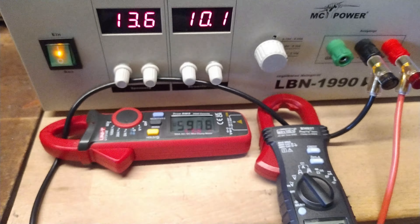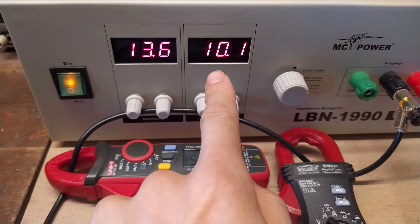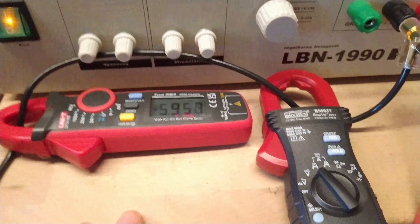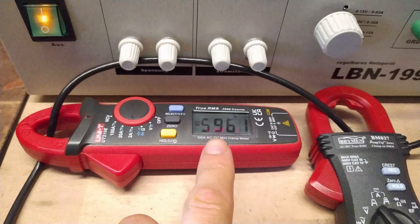If you have a very noisy source of current, you can see we're pushing like 10 amps into a battery here and this meter is correct, but here you can see it's absolutely off — over 6 amps off if you're in this lower range.